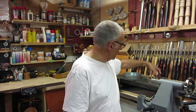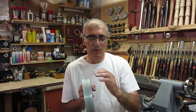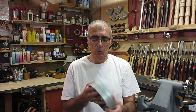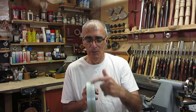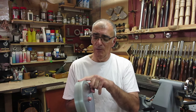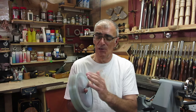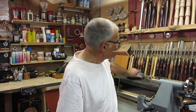The other wheel I got is the fine wheel, which is between 220 and 240 grit. The mark down the centre is something I did - it has nothing to do with the wheel and doesn't affect its capabilities at all. There was a film on here and stupidly I didn't remove it before I tried the wheel out. It is removing as you can see, it just looks a bit unsightly but doesn't affect performance at all. The abrasive side goes to one side of the wheel as well, which is handy for certain applications. They're factory balanced and you do need a bushing to fit your particular spindle.